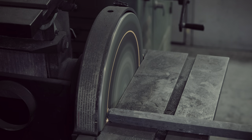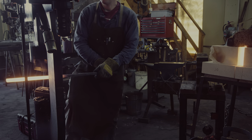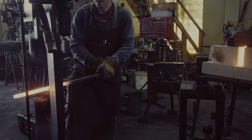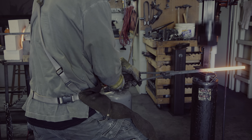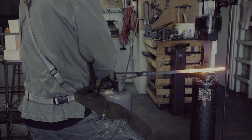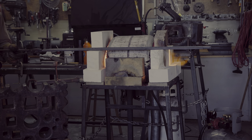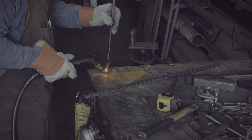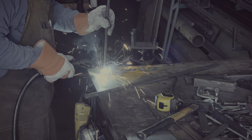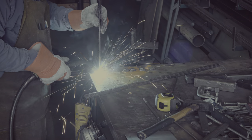The bar is now at 3 quarters of an inch square, and occasional normalizing of the steel helps with obtaining a more fine-grained homogeneous structure and may also help with creating stronger welds. A thousand years ago, this process would have required several helpers who would constantly work the bar with hand hammers. This may also give you a sense for why swords were highly priced and only affordable by a small part of the populace. So far, I have created two long square bars with 9 layers of 1075 and 15n20, always 3 eighths of an inch wide — about 9mm.